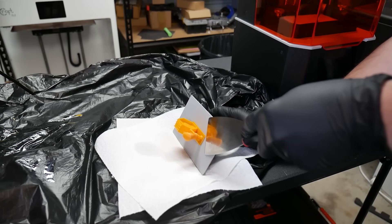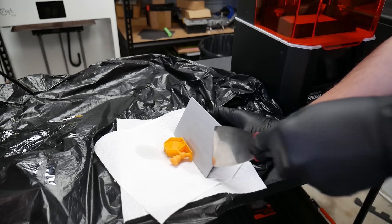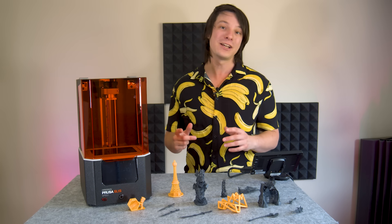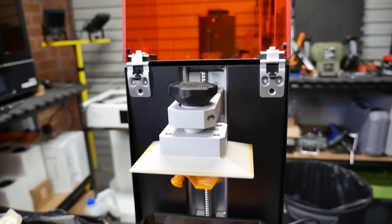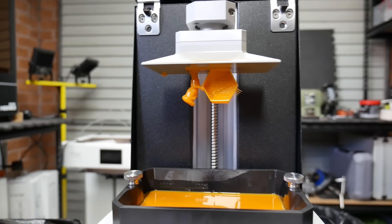Once washed, you can remove your parts from the print bed. I like to remove the supports at this stage when they're a little bit softer before curing, then you put them back into the machine with the IPA vat removed for drying and curing. Something worth noting: after you wash the print with the print platform, the solvent evaporates off it and actually chills it down quite a lot, so make sure you've warmed it up again — I put mine on an FDM printer's heated bed at about 50°C. Make sure it's warmed up again before running the next print, because having it cold would be a bad idea.